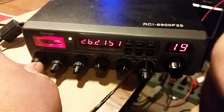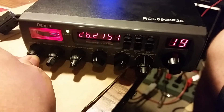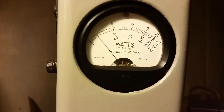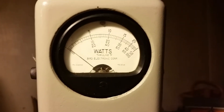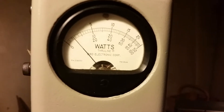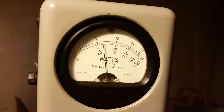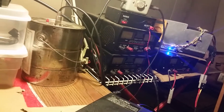Just to show the transmit — we're on the 100-watt slug here, in PEP mode. Let's turn it to AM. It seems to have about a 2-watt dead key or so. Oh yeah, it's transmitting about 25 watts. Let's turn that up and try something here.